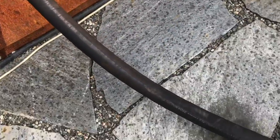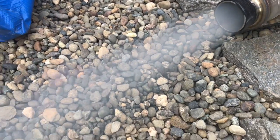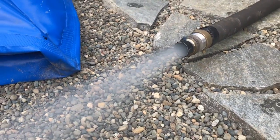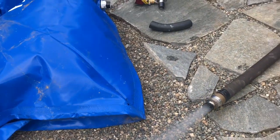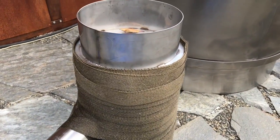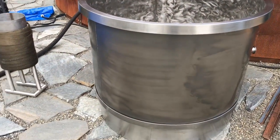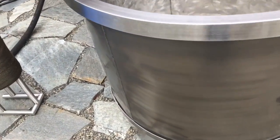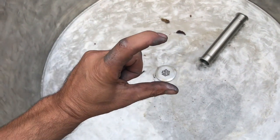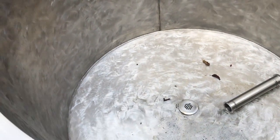All right, we're outside. I got the gas line here. Right now we're getting up the gas phase — we just fired up so it reaches the right temperature. It'll be making fuel gas. There's a little flare burner forge here. This is what I replaced the water heater with — I don't have any water in it right now. I put a big spiral in and did a double bottom so you can pump hot gas around the bottom and the heat rises up. Pretty cool.